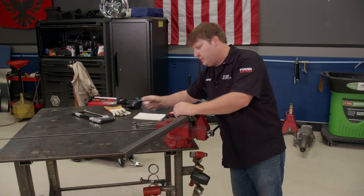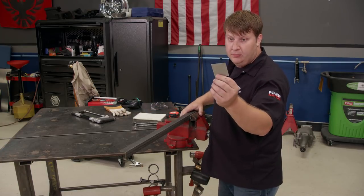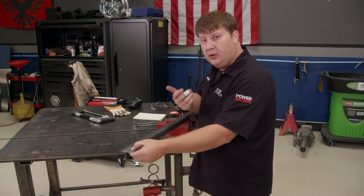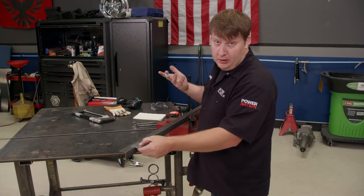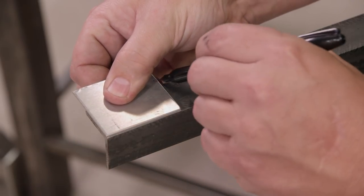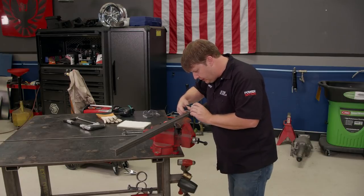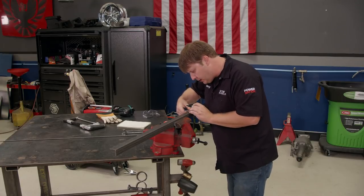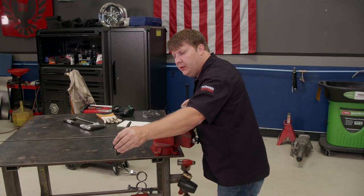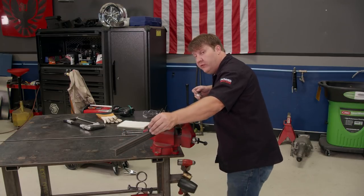So to simplify things, I made a cool little piece of aluminum that's the exact width of that, and all you've got to do is lay it up there, make your mark, move it back, make another mark, and so on. I got to thinking I can make this thing a dual-purpose holder, and all I got to do is make a mark here and take a quick trip over to the drill press.